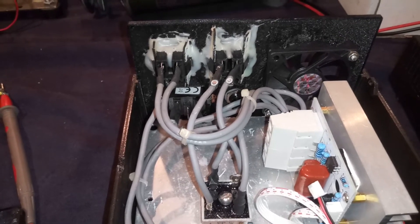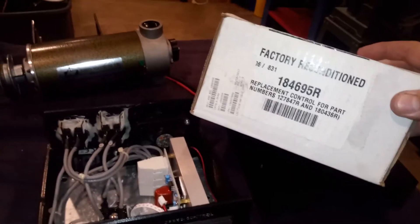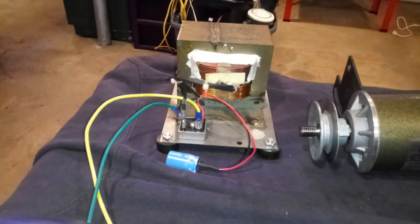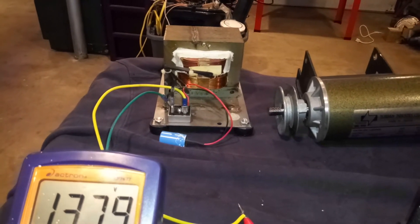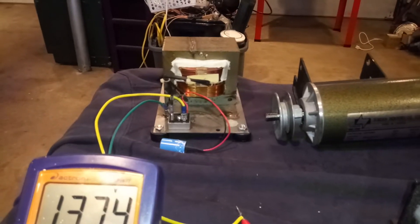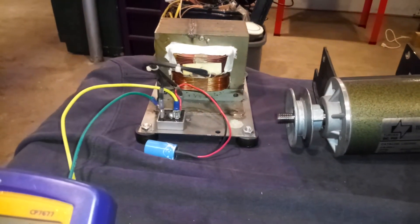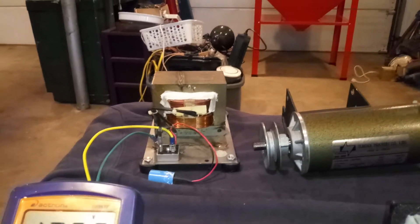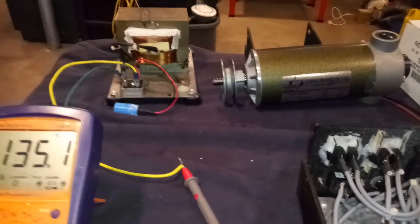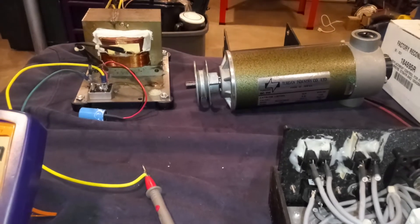It works, it works good. I have run it and it works fine. All in all, I recommend using the factory board; if you can't, then I recommend the transformer method — works great, plenty of power, doesn't overheat. The big thing is just make sure when you put the transformer together, I re-tack-welded it so it's sealed and solid. When you plug it in there should be very little hum — if yours is vibrating and humming like crazy, odds are you might need to redo it.